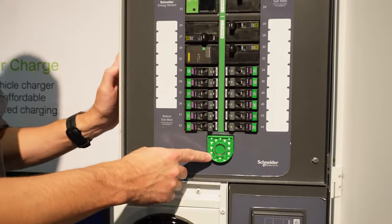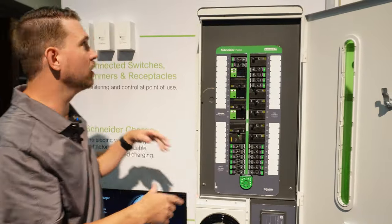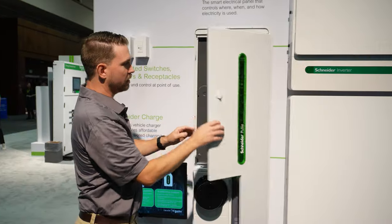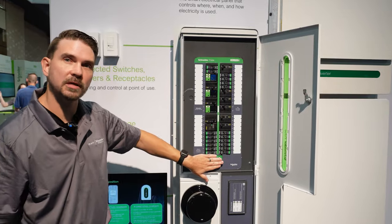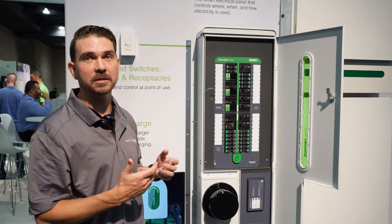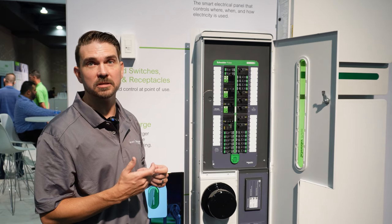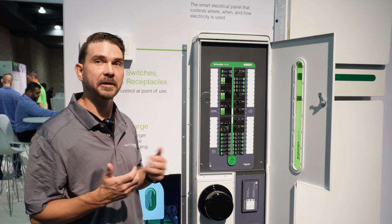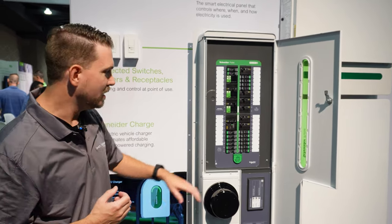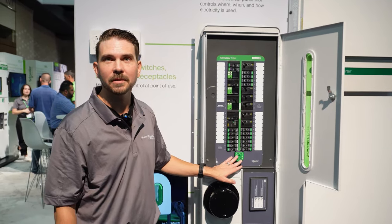The built-in ATS - this little green thing is our symbol for our Wiser relay, which is the brains behind the entire unit. That allows you to monitor all your circuits all the way down to your smart devices, whether it's a receptacle or a switch. With this Wiser relay it goes to a smart device on your phone, and that device allows you to do load shedding and also just monitor the circuits - so you can see where your power is going. If your water heater is taking 30% of your electric bill you might want to change that. The system will take about three weeks to learn what your house does, and after that you can get as detailed as you want.